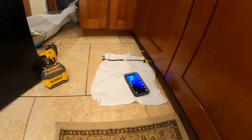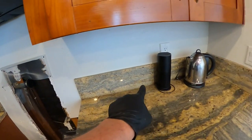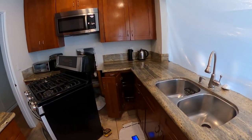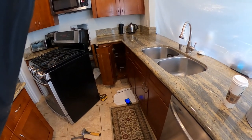Check this out — went ahead and made an incision underneath. This is the lazy Susan area that had some really bad odors, right? I removed the toe kick and used the ferret camera. Look at how much nesting there is underneath the kitchen cabinet — massive amounts. What was happening was they were coming through the waste vent right there, dropping down, utilizing the electrical here, then going underneath the tub. They were migrating between the tub and this kitchen wall, back over here and then underneath the kitchen sink — nesting under the tub, behind that wall, and in the kitchen. This is a huge benefit by opening up these materials and exposing everything.